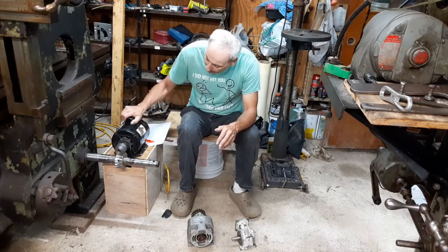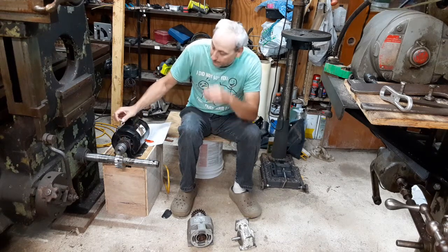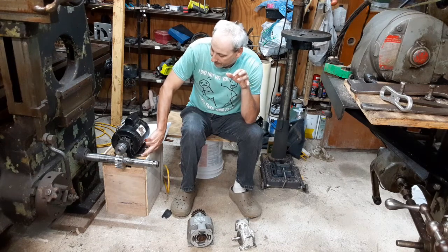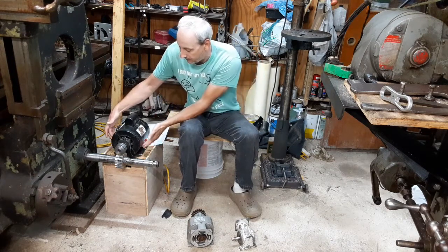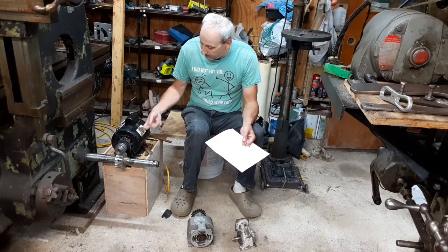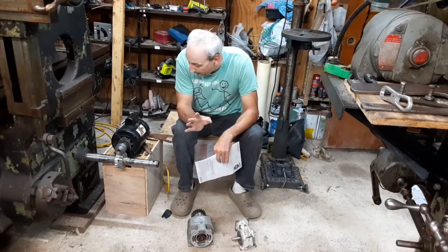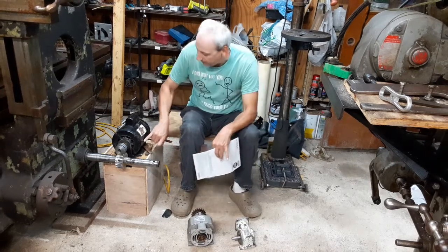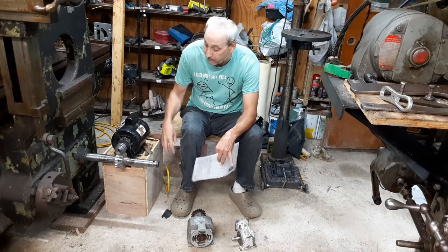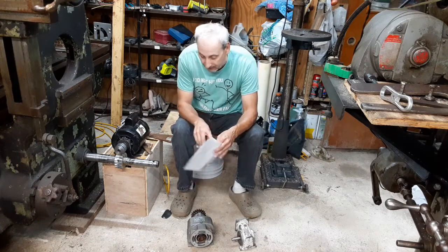For this to continue, the motor is currently on a really flimsy mount with a rubber isolating motor mount. I actually started building a 5/16 inch thick steel plate to mount this on — I was going to weld the housing of this motor to a piece of steel that was solid enough to mount here so it wouldn't react from the torque of all this.